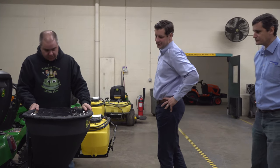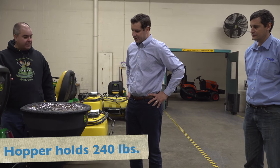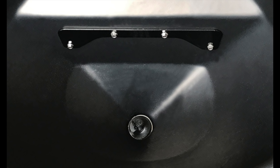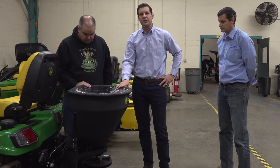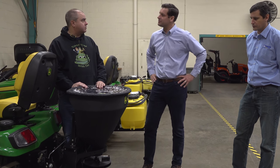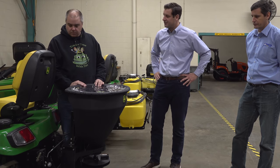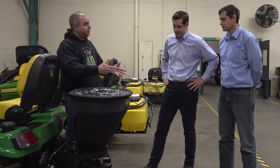This is a salt spreader, and this cover keeps it from getting wet. When you have something like rock salt in this spreader — it has a neck with an auger that pulls out the material — you typically want to protect it from the elements. You don't want the salt to wick moisture out of the air. If you let it sit for a bit, it becomes one big brick. It's got a little auger in the bottom and a pan to keep it from bridging.